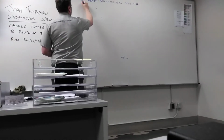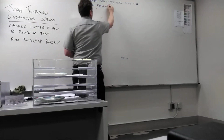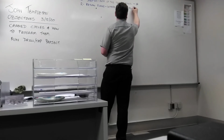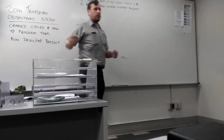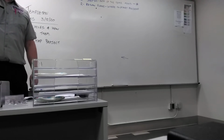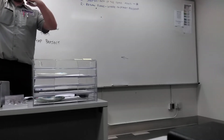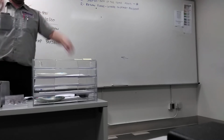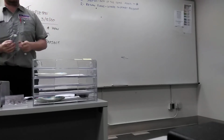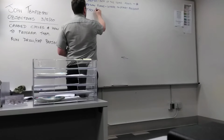You need an R value. R value is where you want the tool to start feeding from. So you can start the tool with G43, H1 or H2, H3, and Z 3 inches. That doesn't mean the machine is going to start peck drilling from 3 inches, cutting nothing. It will read the R value, rapid to that position, and then start feeding down. And that R value is typically how much? Typically 100 thousandths.